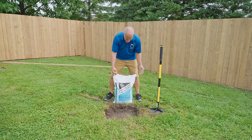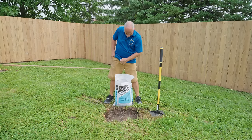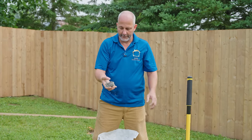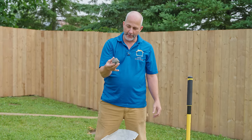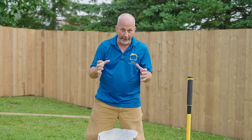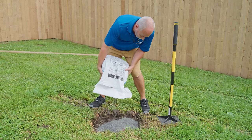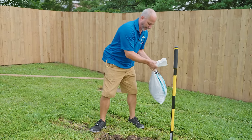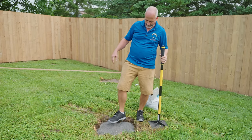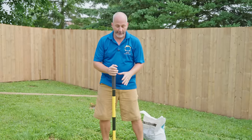Where I live we have limestone screenings — limestone is everywhere in the quarries, so this is a byproduct of quarrying and it is a fabulous leveler. This is stone dust, and it packs together pretty darn good, which is why it makes such a really good structural base. When this stuff is wet it actually has a bonding element to it — it kind of becomes like a concrete block, but it's great for drainage as well. So we're going to put in enough to go about an inch to an inch and a half, level it out with our feet, and then tamp it down into something structural, nice and flat, so we can put the camo block on.